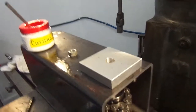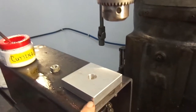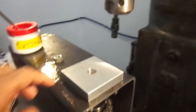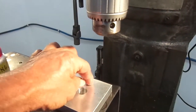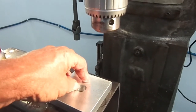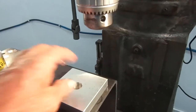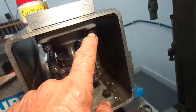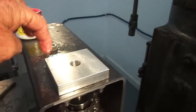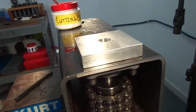I thought I had my camera recording. I didn't. I was showing you pushing this thing down on top of these caps on these boats. Will it fit snug? So now I got the drill. 1, 2, 3, 4. I'm gonna put 4 holes. I think I'm gonna put 3/8 down in there. Countersink these. And that way, have 4 bolts. Any way this thing come loose, it have 4 bolts going through, threaded in here. Then it have 4 bolts going through here, threaded back in this bearing again. So it ain't going nowhere.